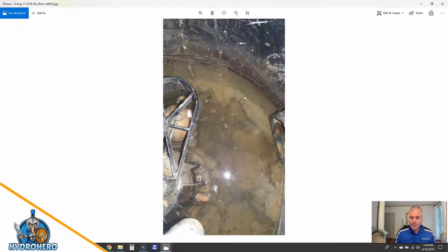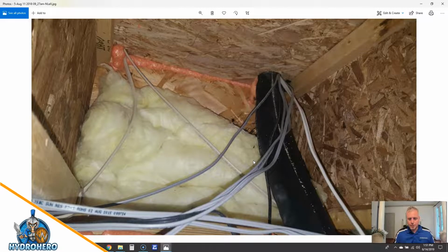Now, we really like it on the negative side, which is the interior of crawl spaces and not the exterior. If you have a problem with it, you've got patios, hardscapes, walkways, all kinds of different things, shower stalls and decorative places that surround trash cans in our area, and stuff like that would all have to come out for us to get to it. Whereas in a dirt crawl space on the interior, which we call the negative side, you pull back the vapor barrier and it's exposed and you can address whatever. So that's what we like to see there.